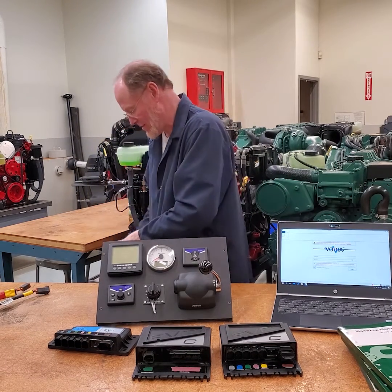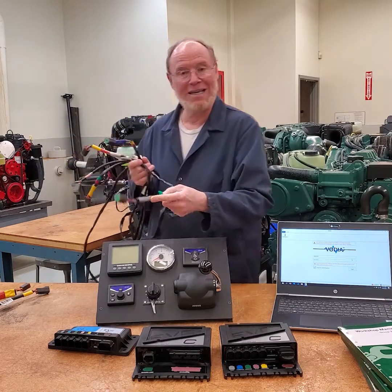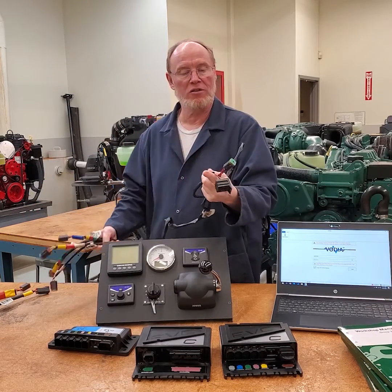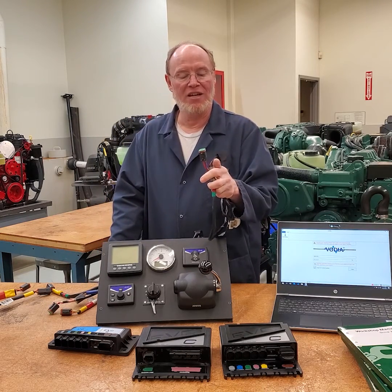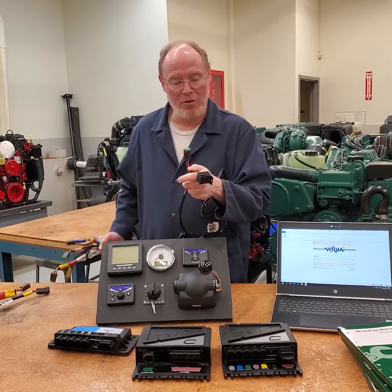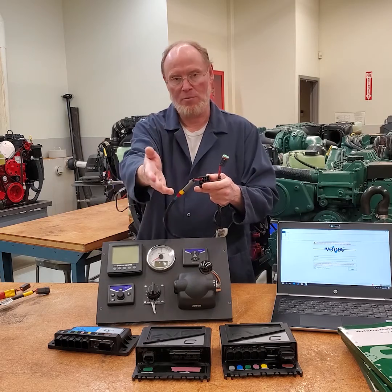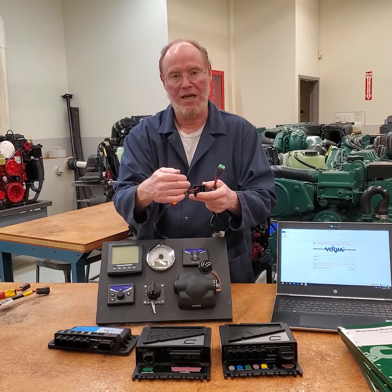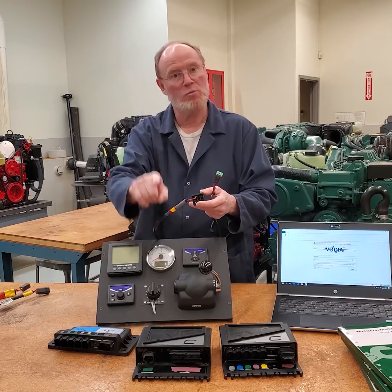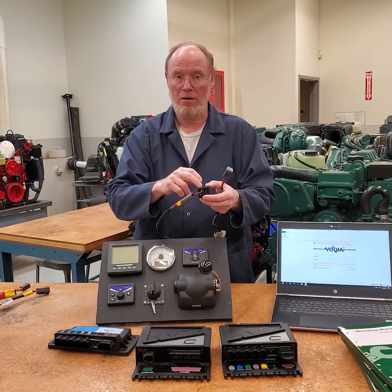Let's plug it in to go over the back side. Your X4 key plugs right into the X4 connector. Off that harness you also have an auxiliary relay. Pins 85 and 86 are taken here — that's automatically wired to the HCU. If you want to add power to this system, you have to install on the back side of the relay plug pins 87 and 30. You'll need to run a separate power supply with its own fuse or breaker up to the relay, then whatever you want to feed — stereo, fan at the helm, lights — you run pin 87 out to a fuse breaker panel. You have to use ABYC standards to get the power from the battery up to here and then out to the device.